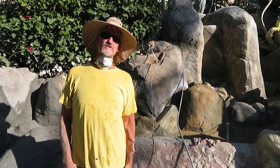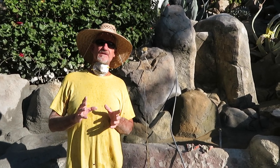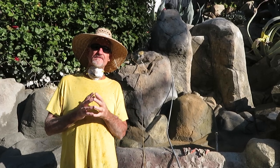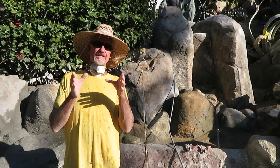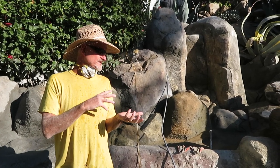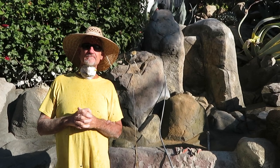We're going to talk about texture coating your fake rocks. Today we're using a technique where we spray the cement on — it's actually a mortar mix — and that's sand and Portland cement with a good amount of acrylic admix. You want to have some kind of acrylic admix in your mud to make it stick better to the substrate, the shotcrete or concrete rocks that you've made prior to this step.